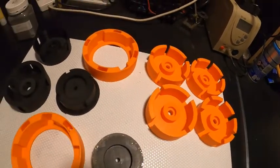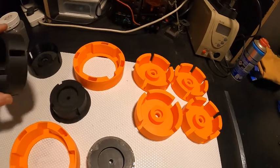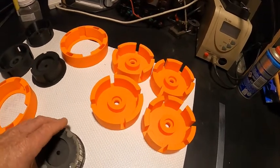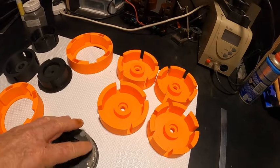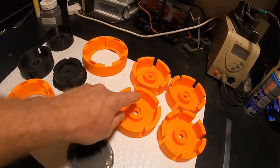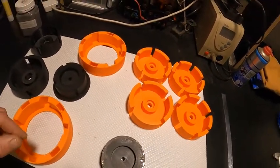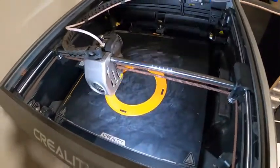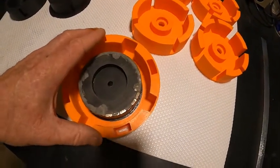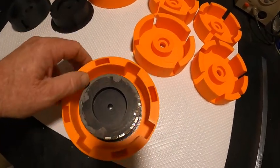That is how we're going so far. We are getting close to the end. A lot of refining has gone into this motor — hundreds of hours so far and still going. This is the final prototype, other than the bearings going in the stator and the shaft being fixed to the rotor. We've still got an outer stator being printed up at the moment. As you can see, the tolerances are about one millimeter out and it's very hard to get it exactly spot on.